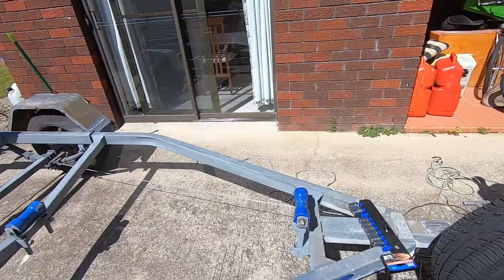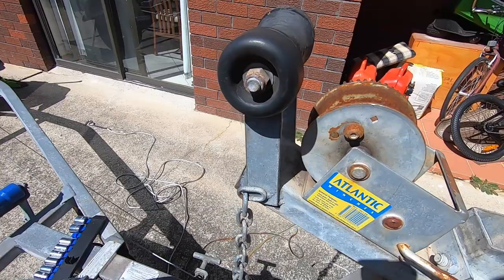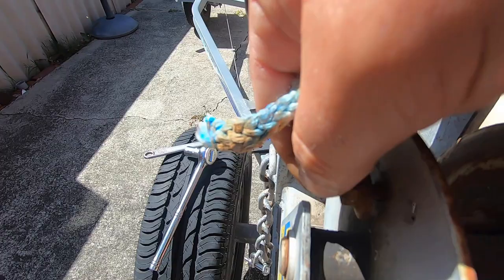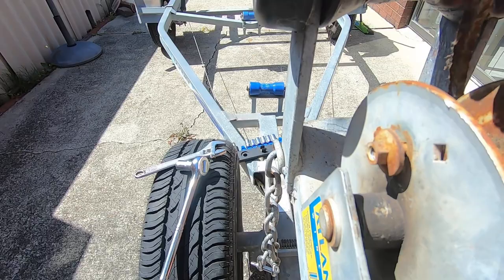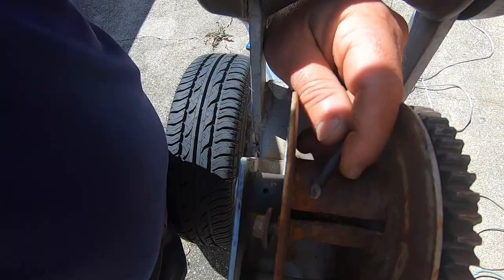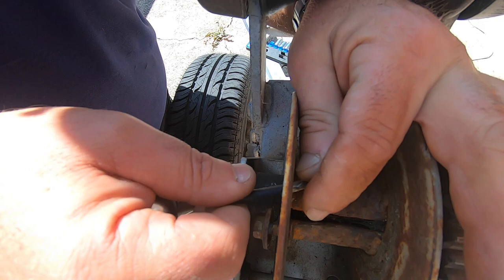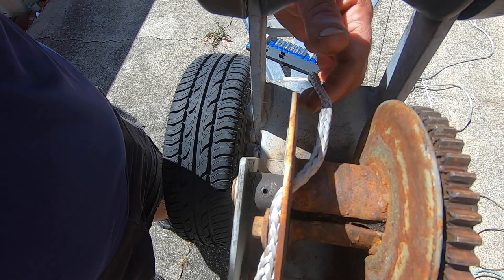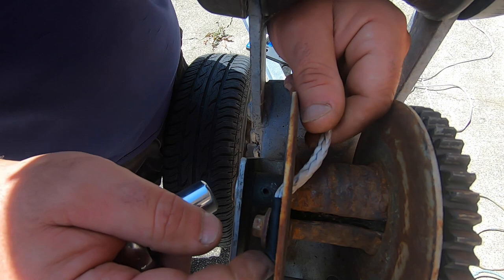What I want to do is retrieve the boat back onto the trailer. First thing is get rid of the old cable — it feeds through and you undo this little nut; it catches on like that. Undoing it now, I'll show you how to put it back on. Crack that through, bring it under — looks like there's another line that goes through as a safety, but it's very rare you need to extend all the way back there.